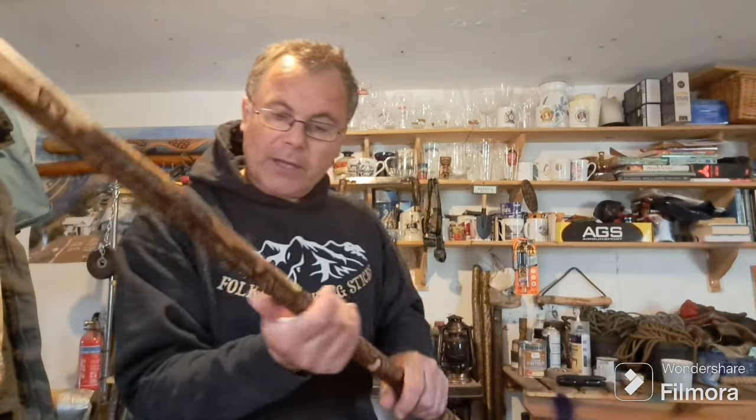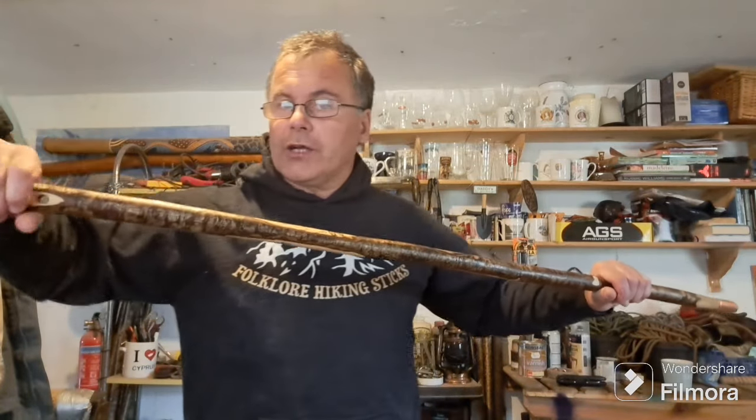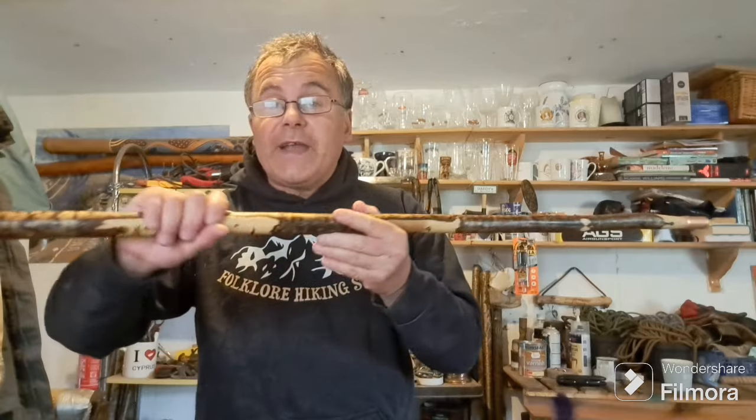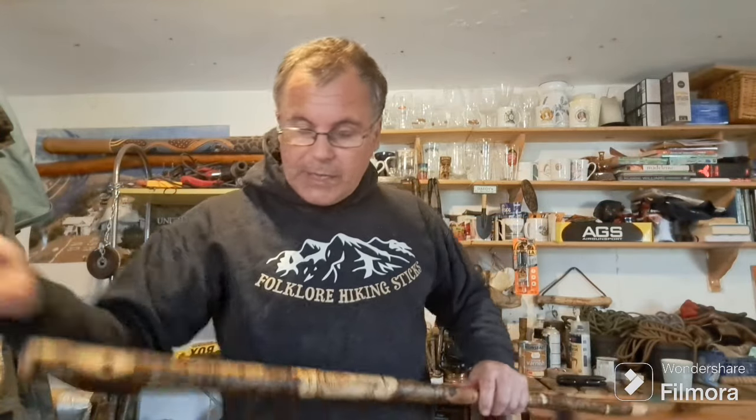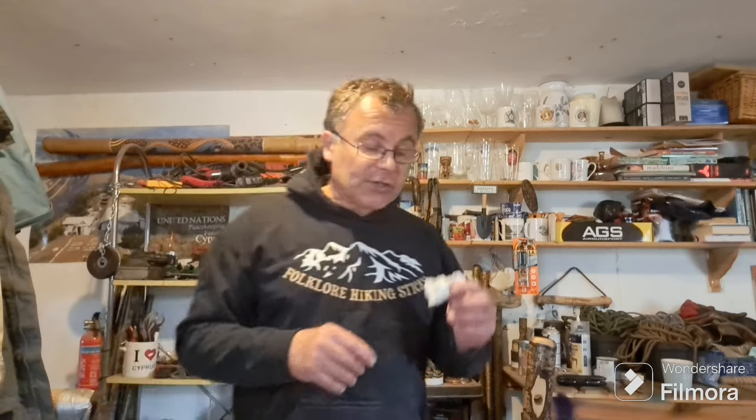So I'm being very careful, just going up through. This is quite a nice stick — it's got a very light, almost dark chocolate look about the bark, almost like a vintage kind of look. I'm going to put this one down and get a new piece of kitchen roll because it's getting overloaded and saturated — it becomes pointless. Anything to do with boiled linseed — as I've described before — you must dispose of all the rags and clean up properly. It will self-combust. So I'll take this down to the fire pit, shove it into the coals, and when I next light it up this will all go up and disappear, with no danger of catching fire in bins or wherever.